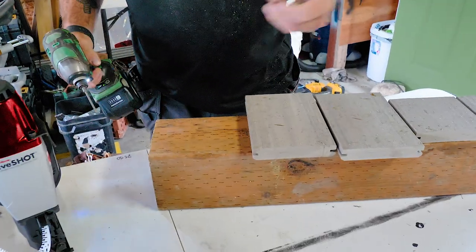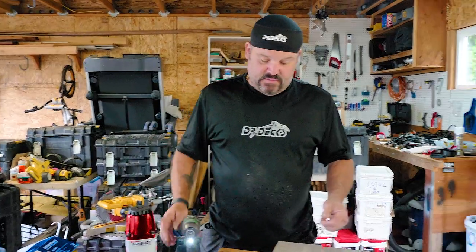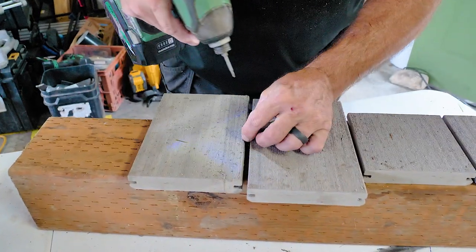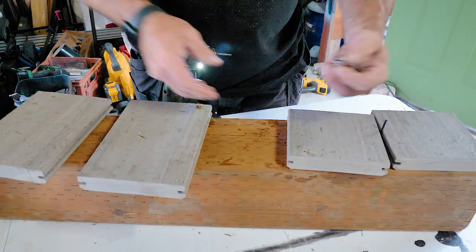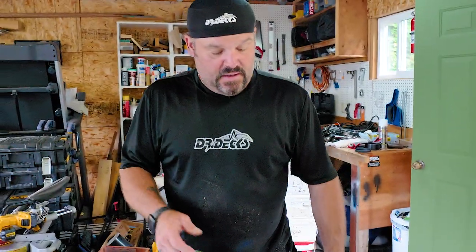The manual system uses a T15, the pneumatic system uses a T10, so you can still go in and unscrew all these clips and remove them if you need to — whether it's to fix something, repair part of the deck, replace a scratched board, or go back a few boards because you made a mistake. It's pretty handy for that.